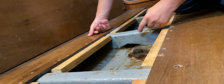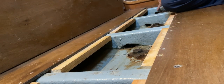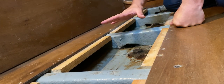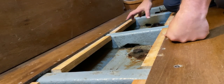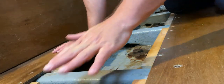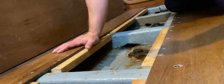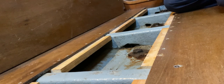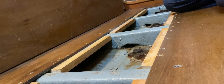There are holes here — you can see one here, and there's a hole here and a hole here — and these are called limber holes. What they do is allow liquid to move throughout the bilge. If there's any liquid up here, we want it to make its way through to the deepest part of the bilge, which is just under the camera where you can't see, and that's where the bilge pump suction sucks the liquid out and takes it away over the side. So when you're operating your bilge pump it will suck from down there, any liquids up here will flow through to the lowest point and be taken away.